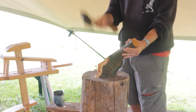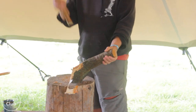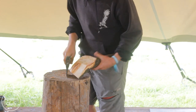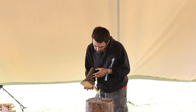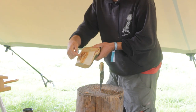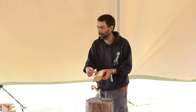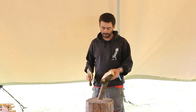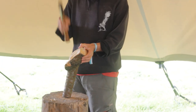I'm just going to take a little bit off the back here to get rid of some wood. As I'm doing that I can see there are two knots there - I'm presuming one of them goes that way and one of them is coming up. I've got to work out which one's which, but I know I need to come back to there at least because you don't need a knot in the bowl.